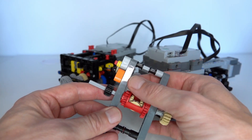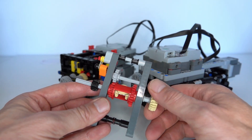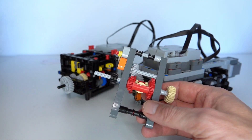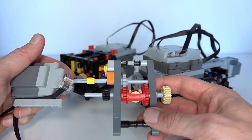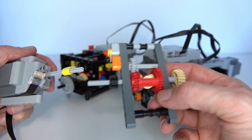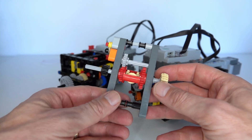Without using the Powered Up hub, you can simply connect some sort of gear-changing mechanism onto an axle directly. But with the Powered Up functionality, what I can do is connect a motor onto that axle and then measure the angle of deflection, and therefore get a torque measurement that I can use to make a gear-changing decision.